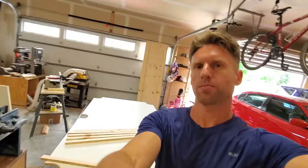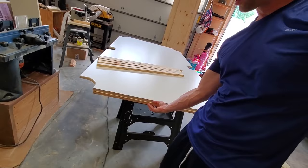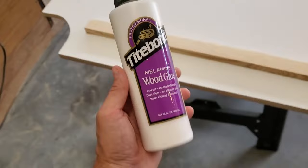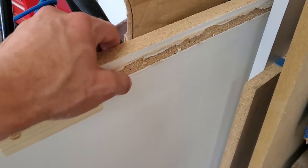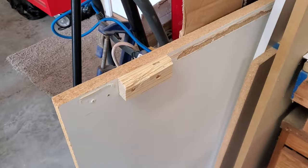I'm going to cut off a 2x4 to make some strips that will get mounted underneath — that's where the cloth comes around and gets stapled to. In order to glue these things down, I tried regular glue, Titebond, and the boards basically just fell off the melamine board. But they make a specialized melamine-type bond which I had to order on Amazon, and it sticks really well. I did a test piece and it actually broke the melamine surface before the glue bond broke. This piece I couldn't even bust off with a hammer. So — buy the right kind of glue.